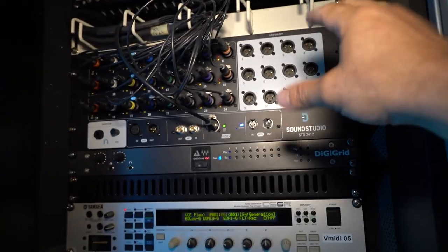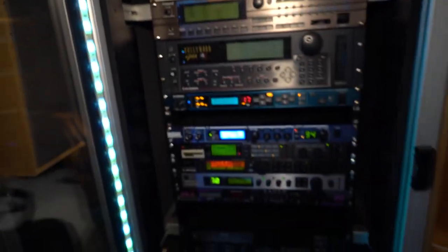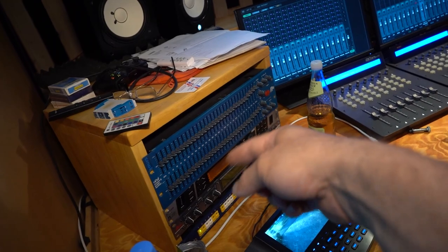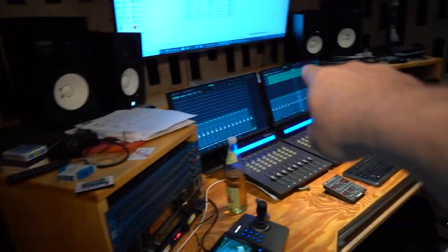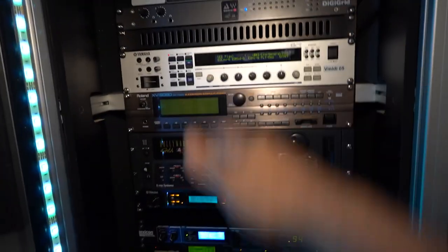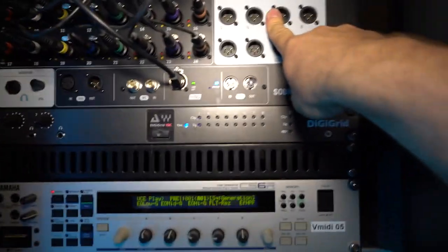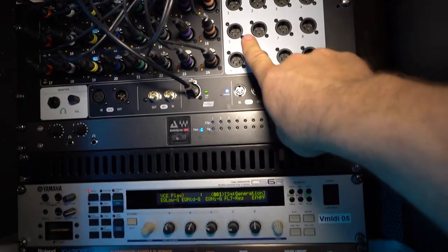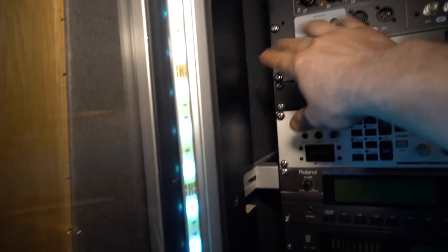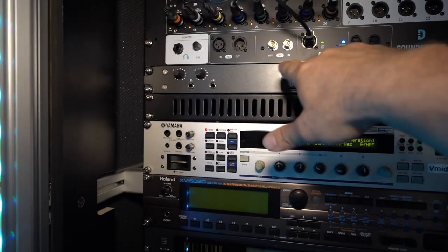Back to the cabinet. This top section is my audio interface, which is connecting all these gears, including the monitor controller section and other goodies here, into the SoundGrid mixer, and from the SoundGrid mixer, of course, we are sending a lot of signal to here. This is the unit for that. This one is purely analog, 24 channel input and 12 channel output, plus a few other channels, digital here on the front, input output, headphone mix and word clock.